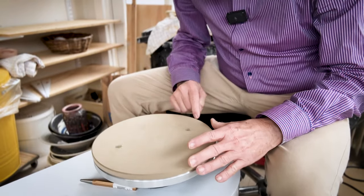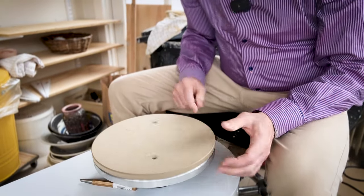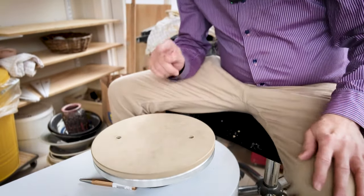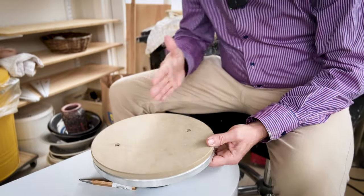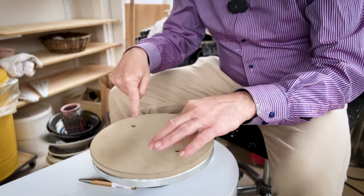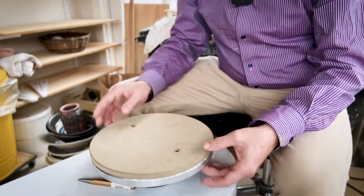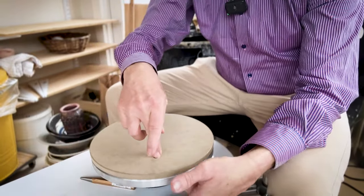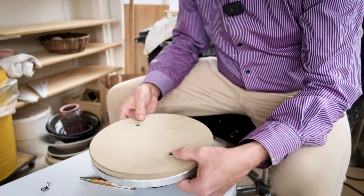There's still a little wobbling — it's a little too much to one side. I push it just slightly. Now you can see it's totally centered. Also important: there are flanges underneath the wheel head to strengthen it, and you cannot screw into those flanges — you've got to put the pins in between them. There's a flange here and a flange here, so the holes go right in between, which also gives enough room for the screw. I was lucky enough to position it exactly where it should be.